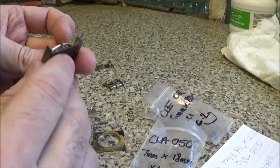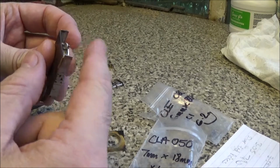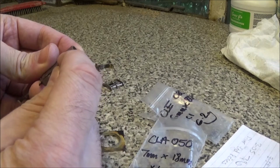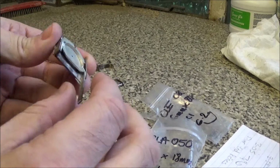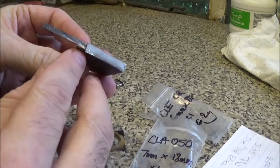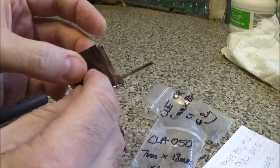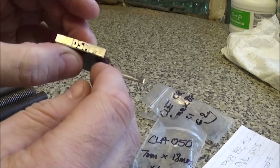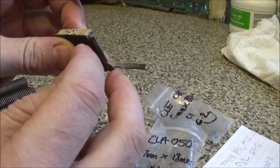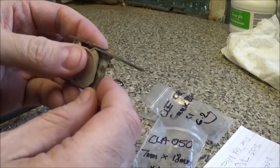As to the actual watch body here, I need to trim back the 18 karat white gold at the end of these, but it's always nice to file them back when the top's on. The trouble is with that then I can't take measurements off the end of it for the holes for the spring lugs. These ones are soldered in place pretty much precisely at the end. Didn't file them back. That one, if anything, is actually slightly short of the end by a tiny amount.